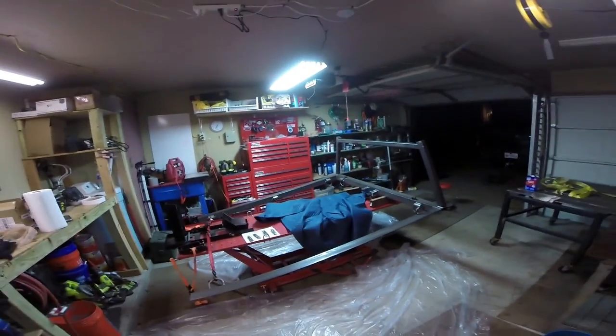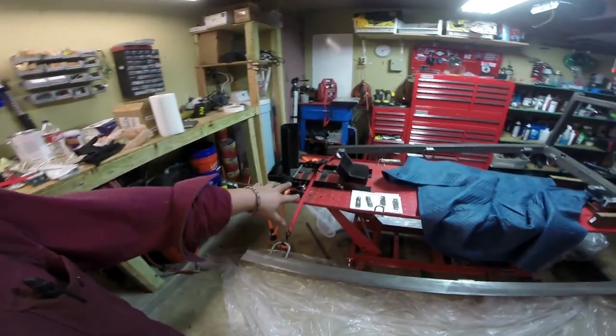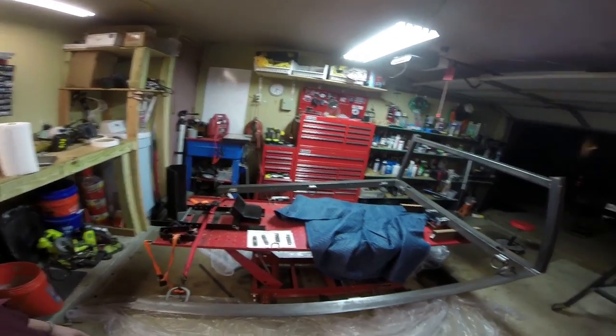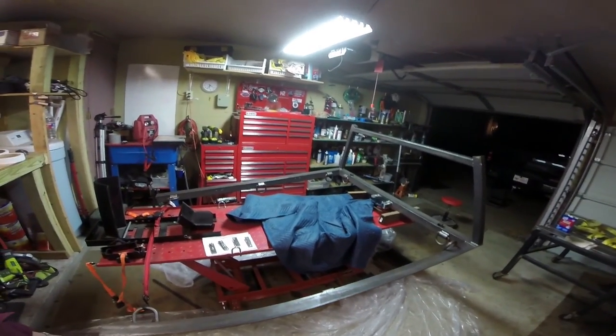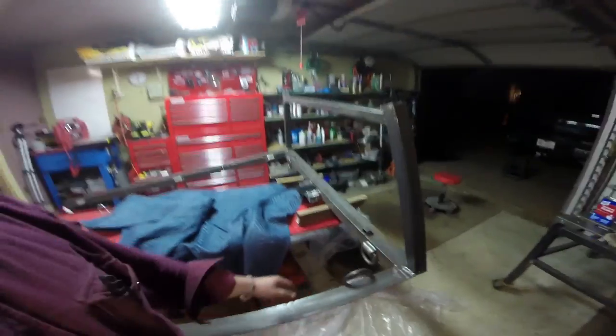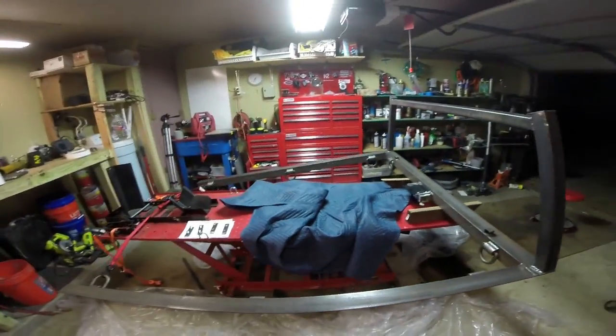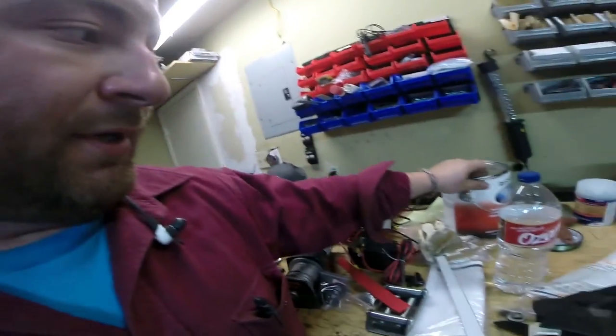We are all welded up, off the truck, and I've wiped it down with acetone. At this point all that's really left to do is paint this thing with truck bed liner. It fits perfectly. We've got our four little block-off plates set up for painting as well. This is going to be kind of a pain because I like to paint all of it — meaning the upside and the downside. I think I'm going to leave the shackles themselves bare but I am going to paint the shackle holder part. One coat now, then the stuff takes like 24 hours to dry, probably another coat tomorrow. Hopefully by the weekend I'll have this thing back on the truck all done. We're painting it with Rust-Oleum truck bed coating — it worked pretty good for the metal stand, so I think it's going to work great for this.